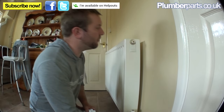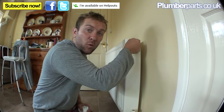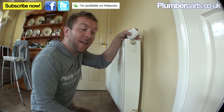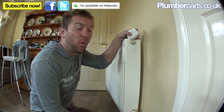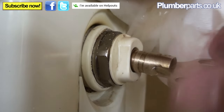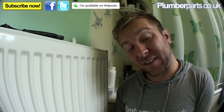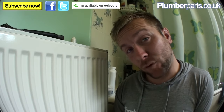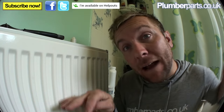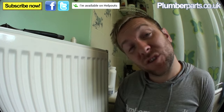Now that's shut off, we can vent the radiators on the ground floor first. As you can hear, there is simply loads of air coming out, so now we just wait. Vent every radiator on the ground floor first, and then move upstairs. The idea is that we let the air out from the bottom and then carry on upstairs and let it out like that.